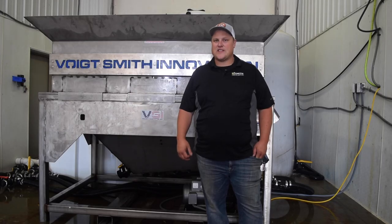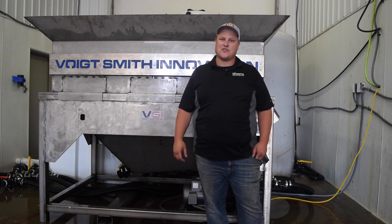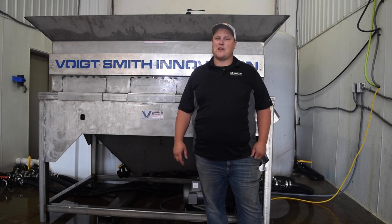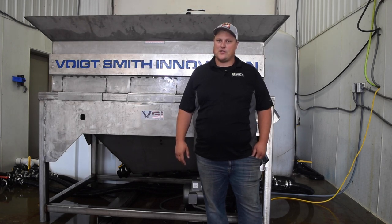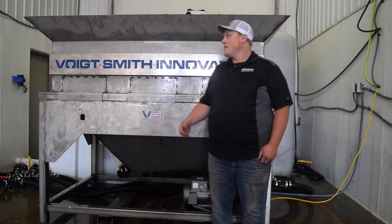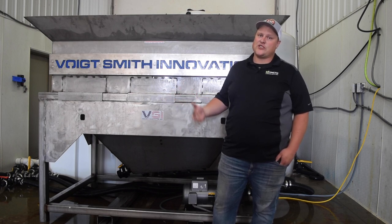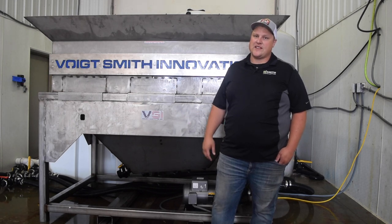So in summary, setting up a brine plant and brine operation like this can be a little bit expensive and time-consuming initially. That being said, we do see that setting up a brine plant has one of the fastest payoffs of anything you can do in your snow business. Typical brine resale markets are selling brine for more than 60 cents a gallon. Whereas with your own system like this, even with salt, water, labor, depreciation, and even your initial setup cost, you're gonna be under 20 cents a gallon.